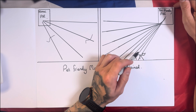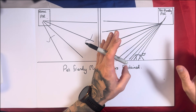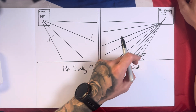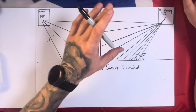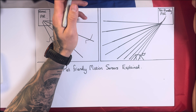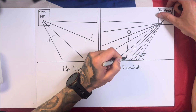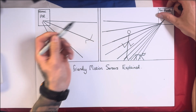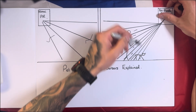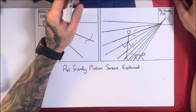The reason for the additional low beams is this: if an object only crosses two of these beams — say a dog — because of the size of the object it can only cross two beams at a time. Therefore the system knows to ignore that, because it can't be a human. It's only intruding on two beams, so it's not big enough to be a human. A human standing up would be crossing one, two, three, four, five different beams — so the sensor knows this is a much bigger object and triggers the alarm.